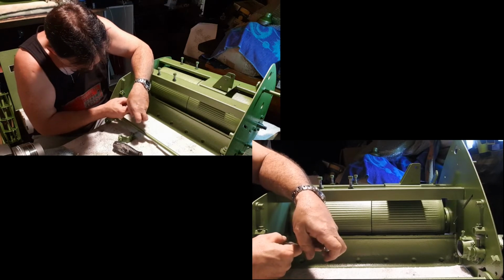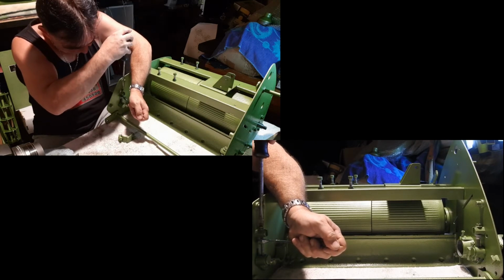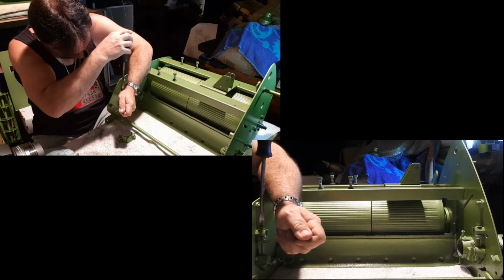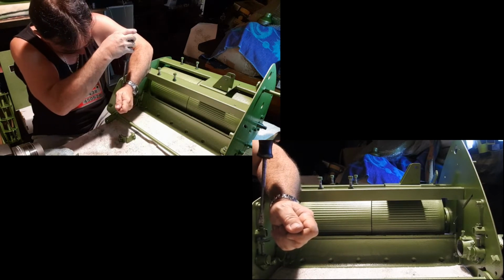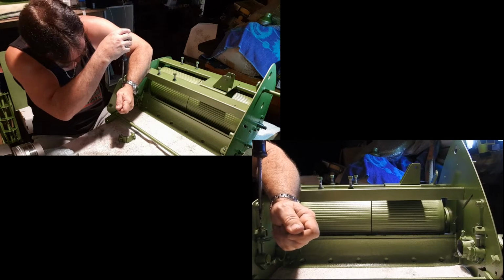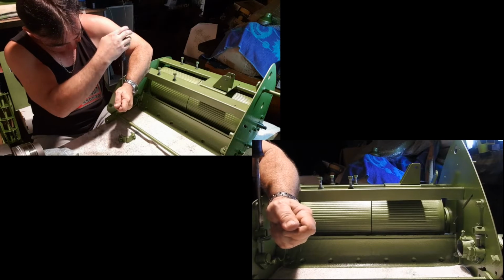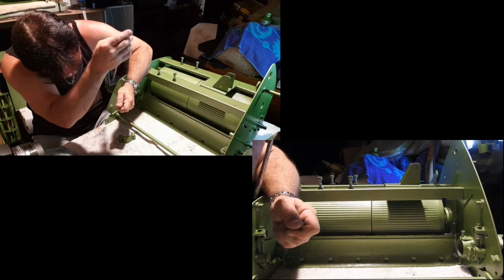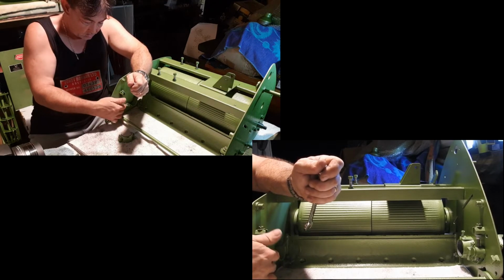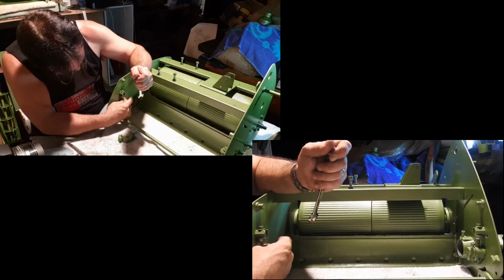And then when you're screwing into your bearing holder, you also bring your nylock nut further up to where it's got to be positioned. Now remember, you want one washer on top and you want a washer at the bottom as well. Keep an eye out that you haven't gone up to your maximum at the top here, or again you're going to break something. So at the moment everything's looking nice.